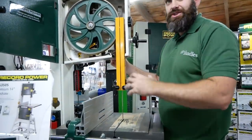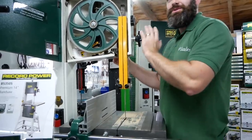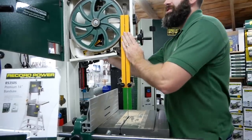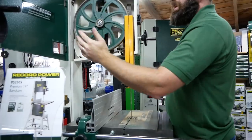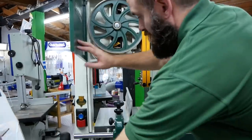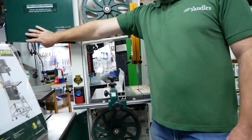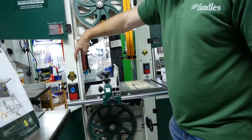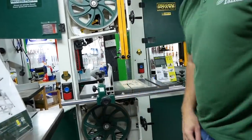Once you've got the tension set well for one blade — because they're all the same length — you put your cam lock on this way, so you know that tension is set. Take it off top and bottom, slide it through this slit here, push these fully out of the way. Wherever you store it, I recommend you try and do it where those can be pushed fully open, because it's just a lot easier for when you've got to get the blade out of this gap here. Otherwise it can foul on the doors.